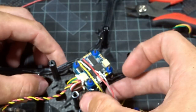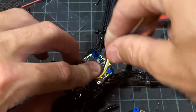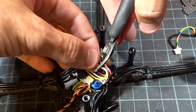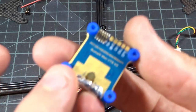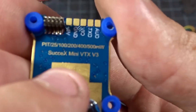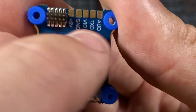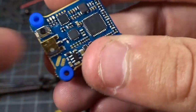Running the four Crossfire wires across the board and looping them up since the receiver will be mounted on top. The receiver should sit about there with more than enough slack. Also, I went ahead and reinforced the MMCX connector with solder — it's all one big ground plane to help dissipate heat. The VTX power outputs are: pit mode, 25mW, 100mW, 200mW, 400mW, and 500mW. All the breakout pads are very handy if you're using this VTX standalone.